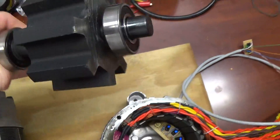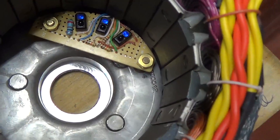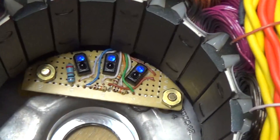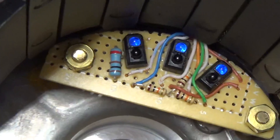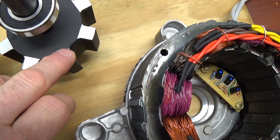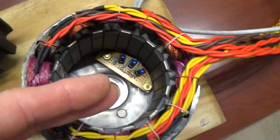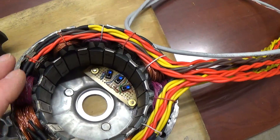This is actually going down like this here, and if we look at the bottom there I've put some optical sensors. It's a three-phase motor so there are three optical sensors, and that's so that it's reflected on each one of these at the correct time, triggering the correct coil.